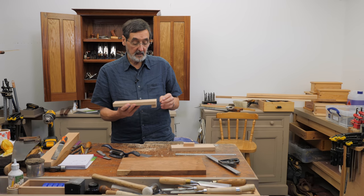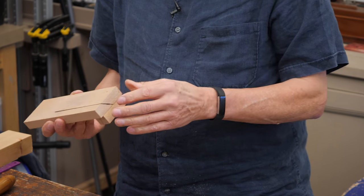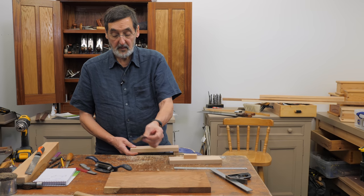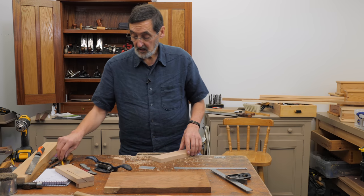I made one of these. This is a honing guide — it's got an angle cut in here dead on 45 degrees. It's got a little turn button underneath that locks this in place, so that when you clamp this in the vise with the plate in it, it doesn't slip. So I'm going to make one for you so you'll see exactly how it's done.